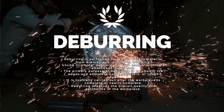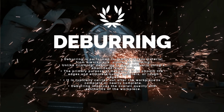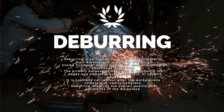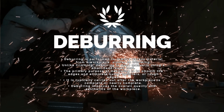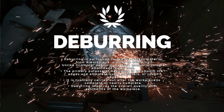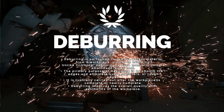Unlike trimming, deburring is done manually using a small hand-sized tool. The primary purpose of deburring is to smooth the edges and eliminate burrs, splinters, or even rough edges. It is typically carried out after the workpiece has been completed or nearly complete. Deburring improves the overall quality and aesthetics of the workpiece.